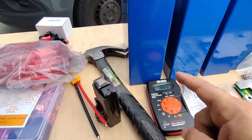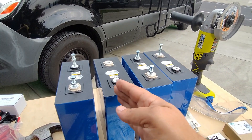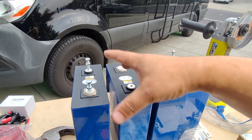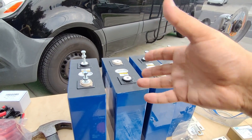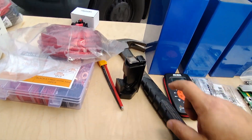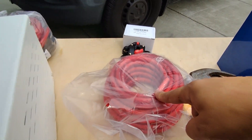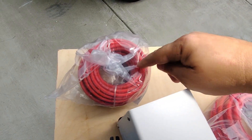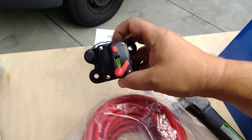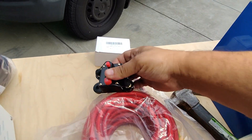You're going to need a digital voltmeter. When the batteries come in they should all be at a similar voltage. If you want to connect them in parallel — connecting black to black and letting all the voltages equalize — you can do that for a couple of days or a week depending on how much time you have. I like to make my own lugs, so you'll need a hammer, a lug kit, and some wire. This is going to be overkill but it's four gauge; we also have eight gauge — the smaller the number the bigger the wire. I also like to use some sort of safety device that will cut off in case of overload or a short.